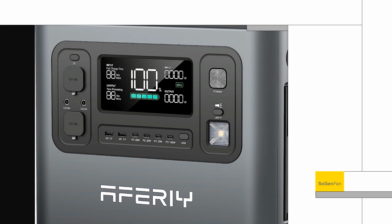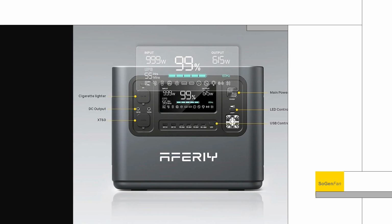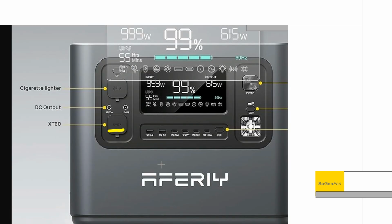This is actually interesting here. We do get a couple of DC outputs, but you can see they list these as both 12 volt 10 amps. So you would probably think there are two cigarette outlets on there, but there's actually only one. There's one here, and this other one, they actually have it corrected on this image here, is an XT60 output. If we zoom in there, you can see that they have that one rated at 12 volts, 25 amps.